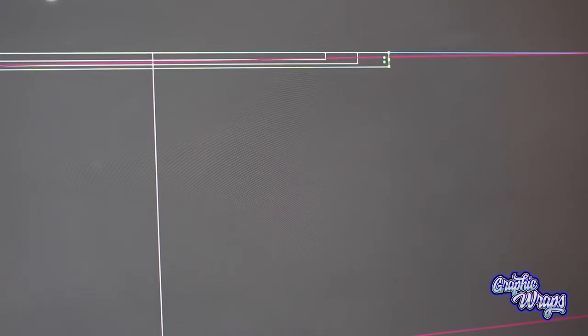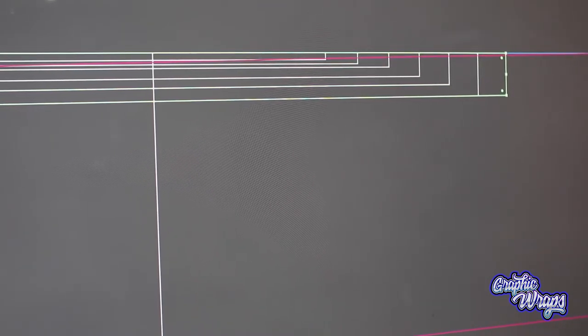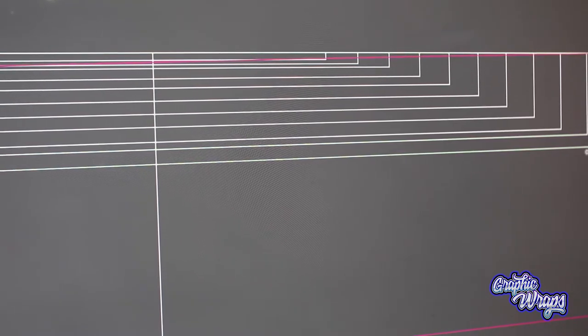Continuing: 5,300mm at 42mm offset; 5,400mm at 42mm; 6,400mm at 70mm — that's 7mm here at 10% scale. At 6,000mm that's 260mm, and the final measurement was 300mm, taken off camera. Now with all those offset points plotted, I'll use them to shape the bow curve.